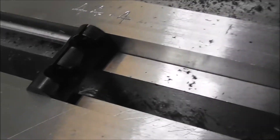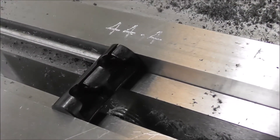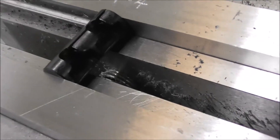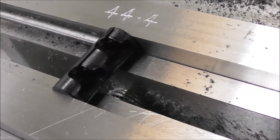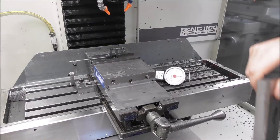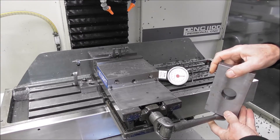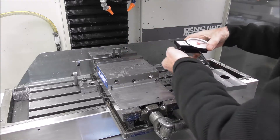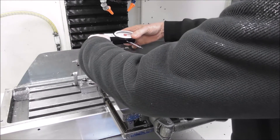You wonder: how close are we to the part slipping out of the vise, especially once most of the machining's been done and the whole part becomes more flexible, and the pressure of the vise can collapse it very easily? So we can do a little test to see how much we're improving the grip — I'll tighten the vise with a weight on the end of the handle to get a known torque.